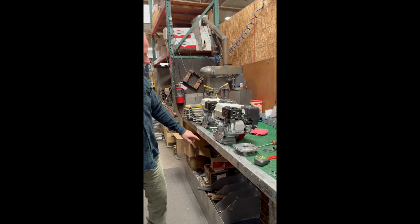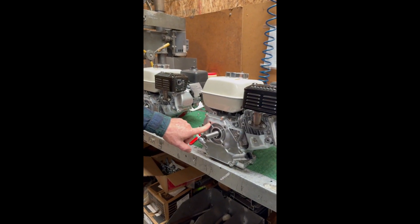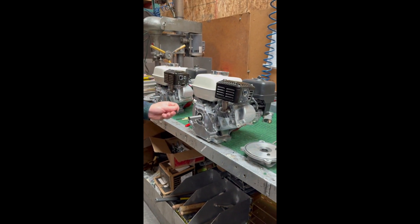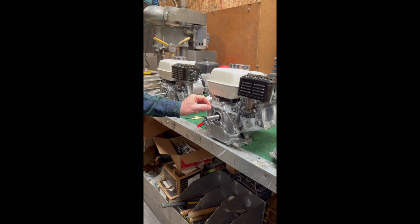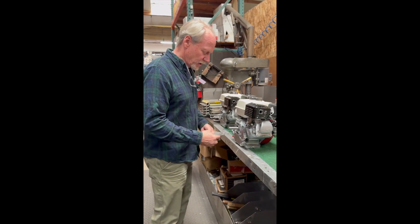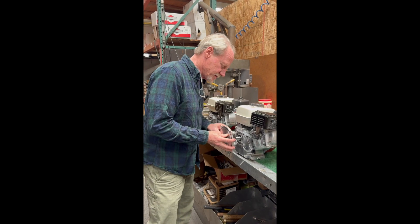If you look at the front of the pump at about the 10 o'clock position, we just come in here and countersink that just deep enough so that when I tighten up this bolt, it's almost flush with it — it can be sticking out a little bit because we're going to attach a plate to it. I've already got my two Allen screws in here, so I'm going to take this and just slide it over the shaft.